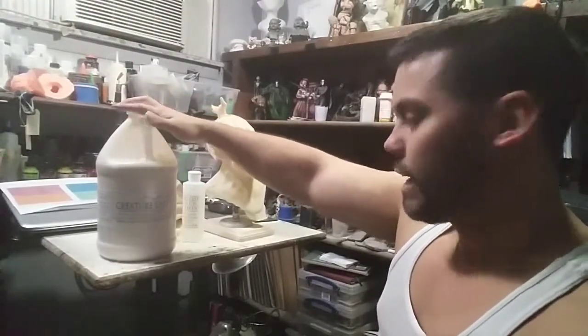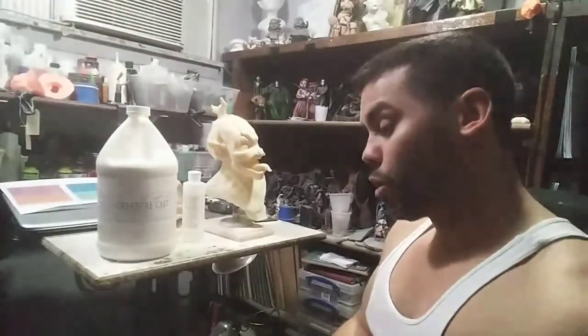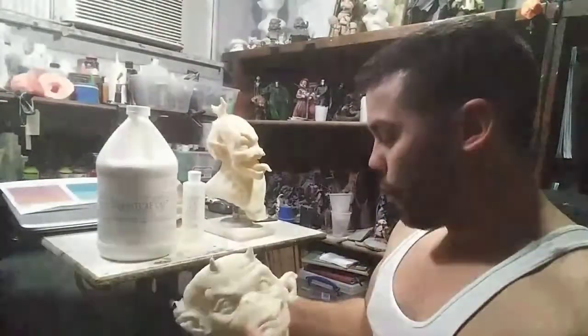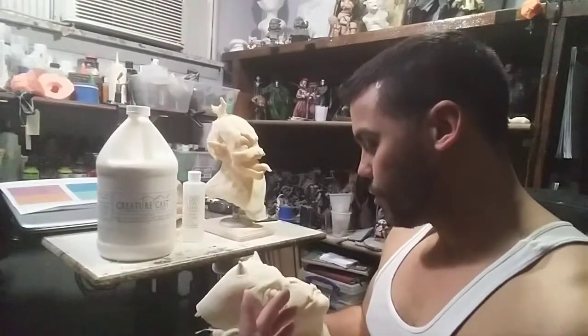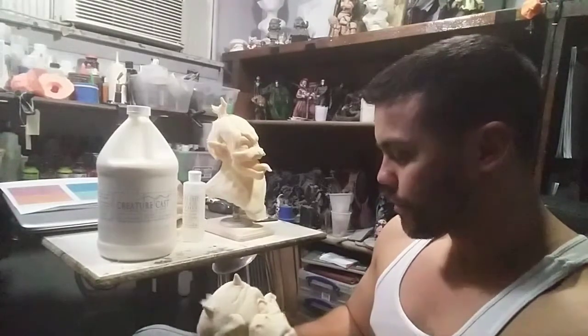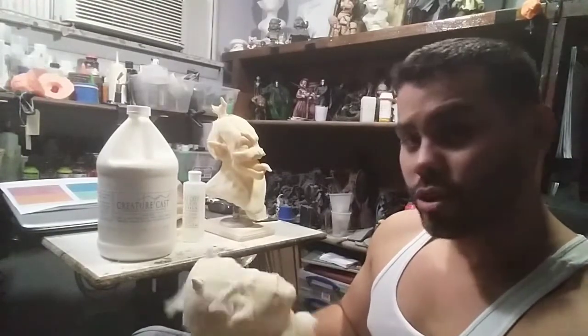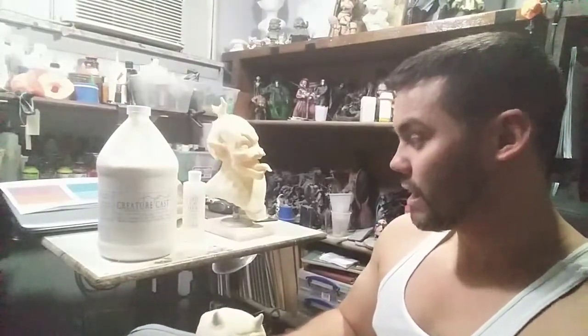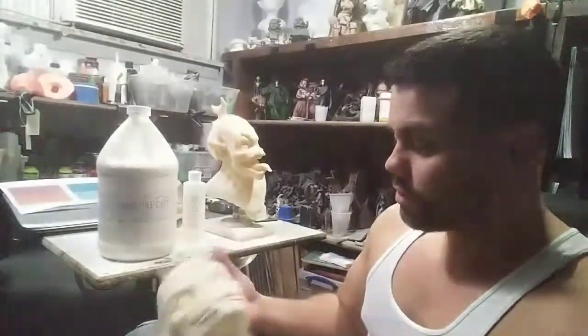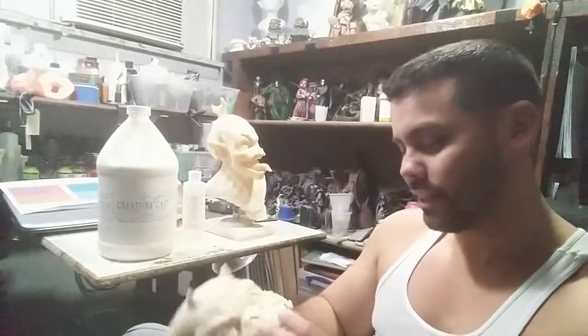The Superflex rubber doesn't dry as quick as the latex does. It does take a little bit of extra time that I noticed. It also is going to take a little bit more time to build it up, so you've got to let it dwell for a little bit longer or do a few more layers than you normally would with latex. However, I do think it is a nice alternative because you're going to have those people that can't do latex because they're allergic, or kids, or things like that. So I mean, that's one nice thing. It's also non-toxic. So you don't have the ammonia smell and everything from latex. It does have its own smell that can get to you, but do it in a well ventilated area.